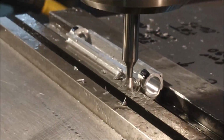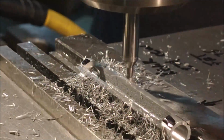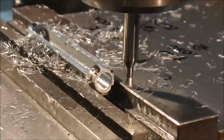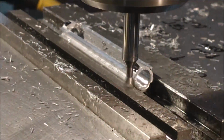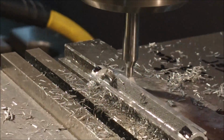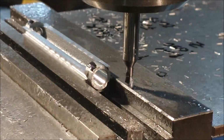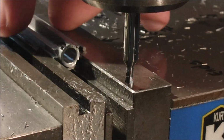When I reposition this cutter for the final cut, which is coming up, watch how the cutter goes beyond where it needs to be and comes back. It happens quick, right there. The dial was turning clockwise on the y-axis, so when I shift to the front, I'm still turning clockwise, and backlash is not an issue. I will get a very accurate cut doing it that way.